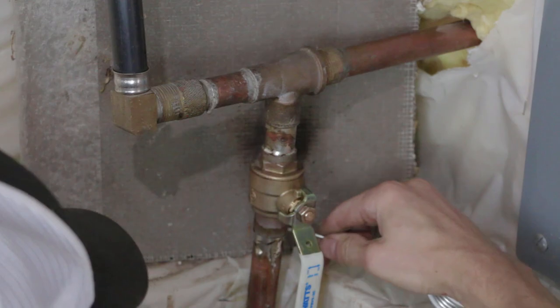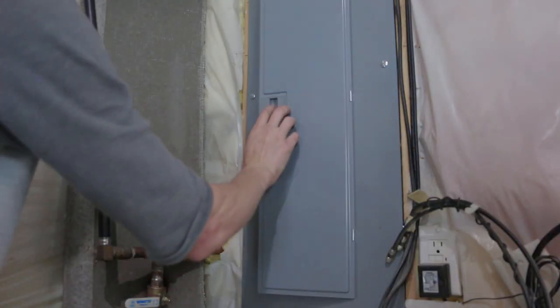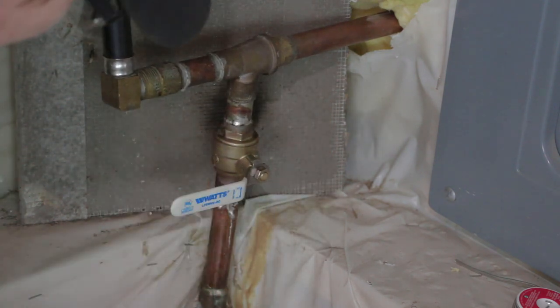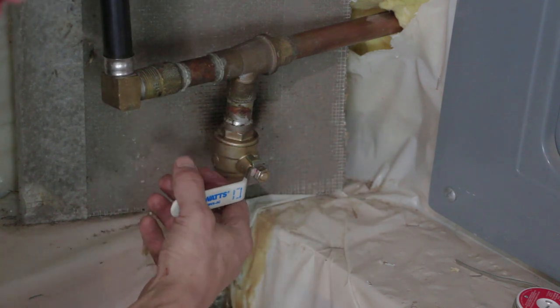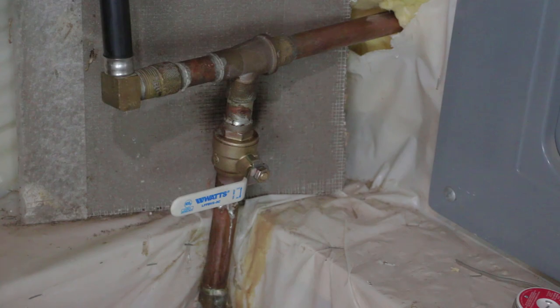The pipe is sweated - letting it cool for a few minutes. Turned the well back on and I'm not feeling or seeing any water leaks at all. Shutting off the water to the hydrant - you can hear the water running when it's on, confirming the hydrant is leaking. At least the shutoff valve is dealt with. One last quick tip: before turning faucets back on, remove the aerator screens if possible - when clearing air from the lines, rushing water can break loose iron buildup and clog those screens.